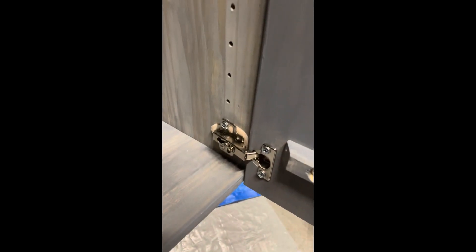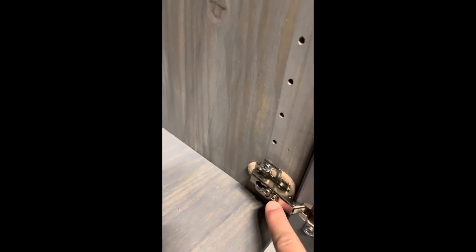Now I'll show you what the final product looks like. With the felt pads installed on all four bumpers, you can screw these out since we won't need quite the offset. What it does is bring these doors into much closer alignment so that you don't have to worry about having that huge gap. This is what I've found to be a particularly useful and inexpensive hack to get these cabinet doors closer together.